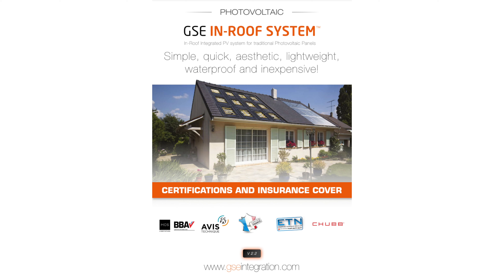I'm going for an in-roof system. The reasons: it's a brand new build so you can save on tiling costs, and aesthetically an in-roof system looks better than an on-roof solution. You also don't have to worry about bird protection - no pigeons trying to live underneath them - so that's another saving. The in-roof system itself does cost a little bit more than on-roof, but I think it's slightly easier to clean since it's in line with the tiles.